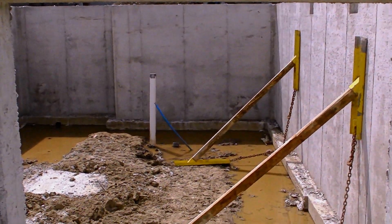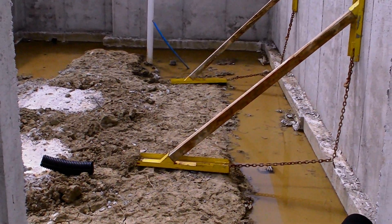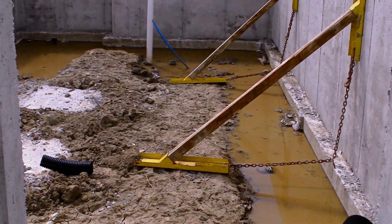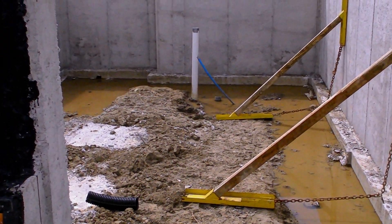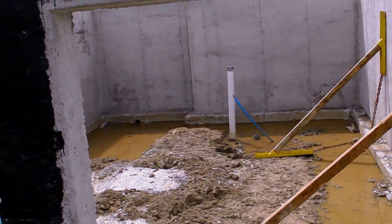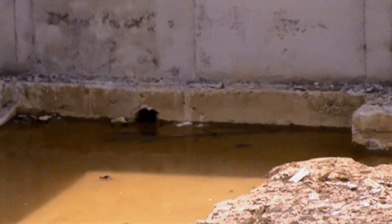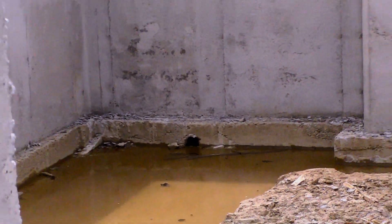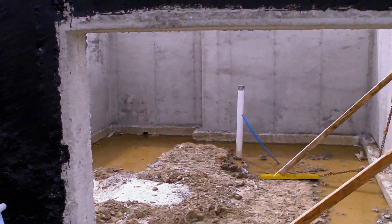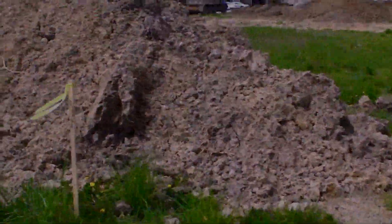You can see the remnants of the crown — that's the raised part we leave to save on p-stone. Right over there, if I can zoom in, that's where the drain tile comes in and links up with your sump. So there you go, there's your basement — now let's get her backfilled.